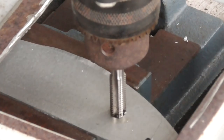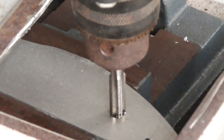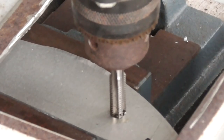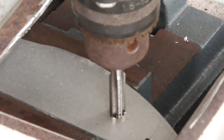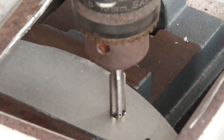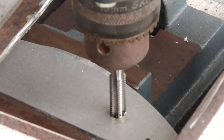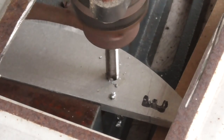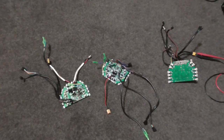After the motor adapter slipped, I tried turning the motor by hand to continue tapping and discovered the chuck is also slipping on the tap shank. That's really not what I wanted to see — even that small amount of force causes it to slip. At least it retracts quite nicely.